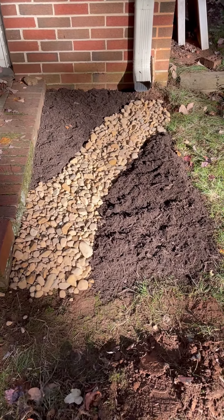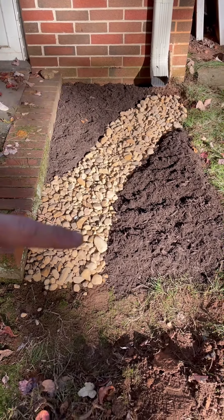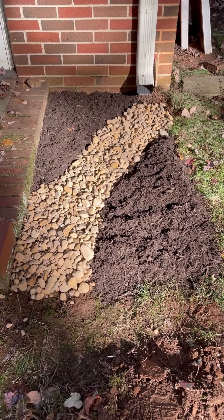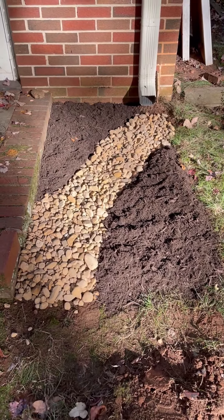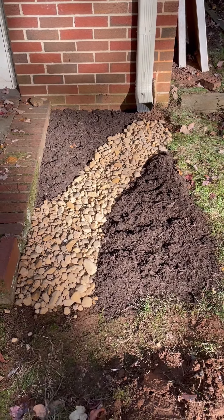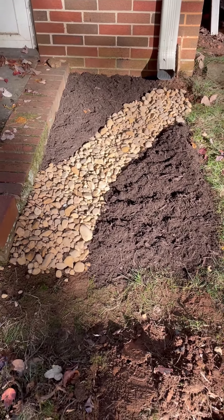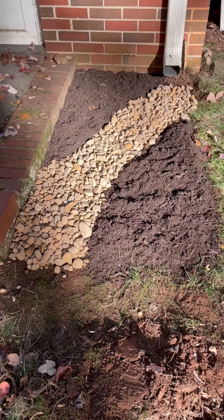This is the look you want — a really nice demarcation between your rock and your mulch. You can always come back; this is going to be a really fertile area with the drainage and water coming from the gutter. You could plant some plants here in your mulch beds to dress it up nicely, but this will take care of our erosion issues for now. You could mix some bigger or smaller rock in, but don't go too small because it will just wash away — three-quarters is a great size to start with. I hope you found this interesting and useful. Feel free to like our page and subscribe below. Thanks for watching.